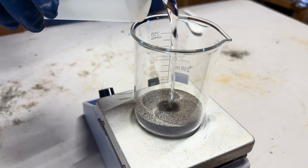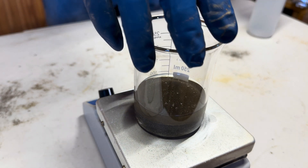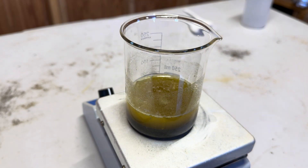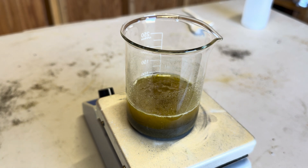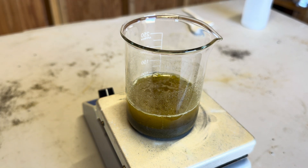We are going to add in our hydrochloric acid to wash our material. The hydrochloric acid will remove most of the base metals inside the material. You can see the hydrochloric acid doing its job. The sulfur content inside this ore was so heavy — the odor of the sulfur burning was very, very strong. Even with the hydrochloric acid, the sulfur smell is very strong. My son doing woodwork about 60 feet away can smell the hydrochloric acid and sulfur.